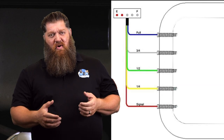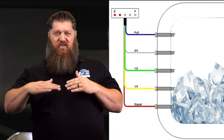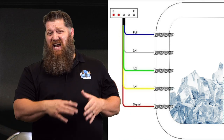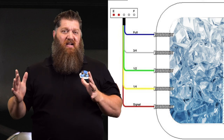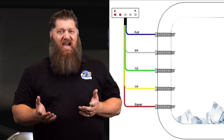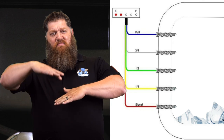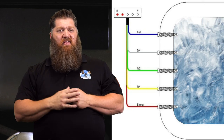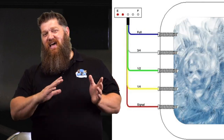Now, there's some thought out there about putting ice in your toilet and flushing it down. Here's the problem with that: the ice has to cross across those sensors, and you have to move that ice — otherwise it just sits still. The hardest part is knowing how much water you have in your tank and how much ice to put in. Too much ice and it's not going to move at all. Too little ice and it'll just simply melt. So while there is some success using ice, it's more of the luck of the draw. Not only that, but you can't clean all three sensors — you've got one at one-third, one at two-thirds, and one all the way at top. That means the ice has to cross all of those, and you'd have to drive like a maniac to try to move it. The best thing to do is get a product that will help the bacteria and also clean off the sensors.